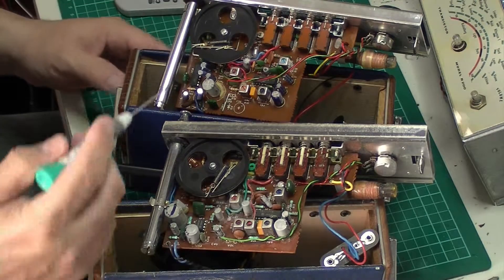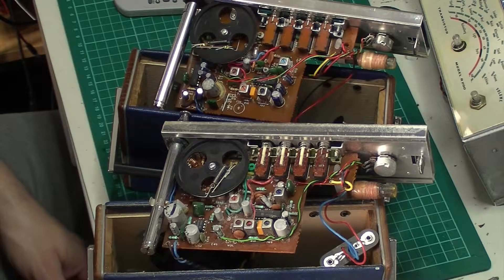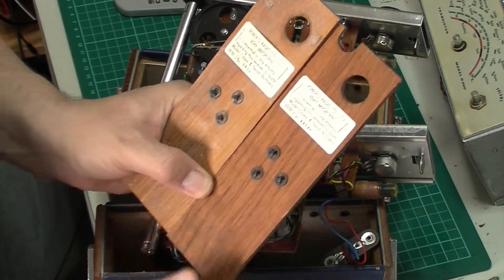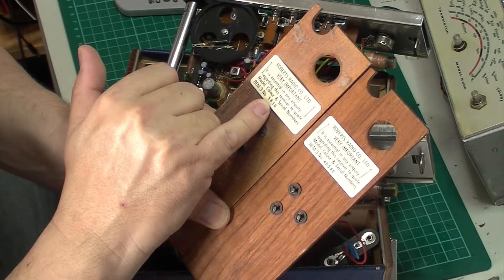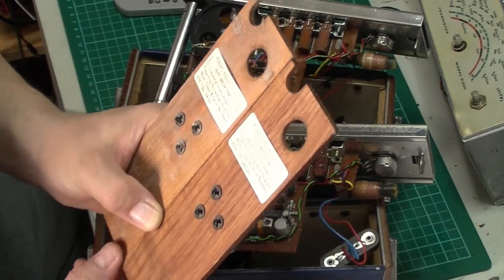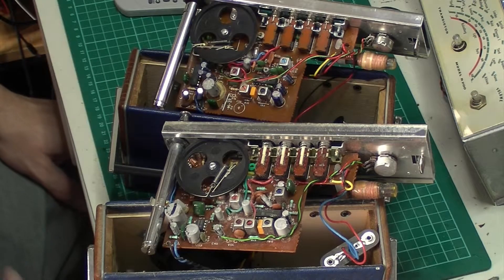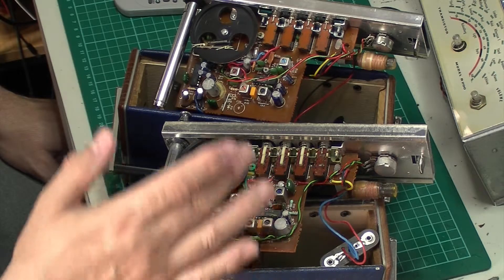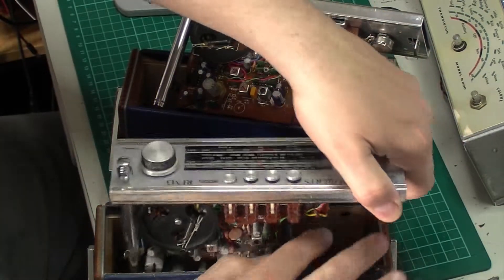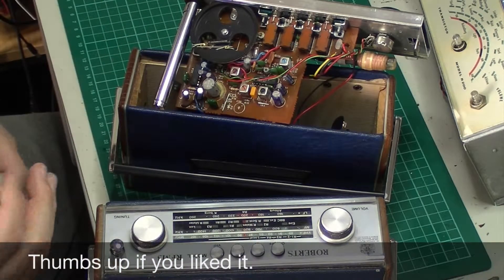I'm going to next have a look at the alignment data for the newer radio. I've got it back out of its case and might as well have a go at checking the alignment, although it does sound lovely. For info, this is the two bottom covers — the older one is serial number 5836, so it's quite an old set, and the newer radio is 48546, clearly over the 22001 serial number. I hope that was of use. I will restore this one but it is pretty much working, and the procedure will be identical. So unless anybody specifically wants me to show that, I shall do it at a later date. Thanks for watching — if that's been of use, give me a thumbs up. On to my next radio, thank you.